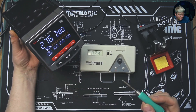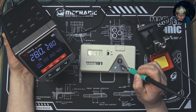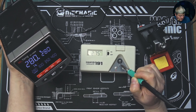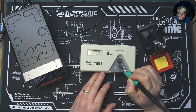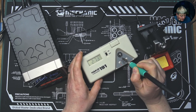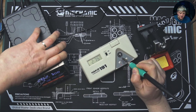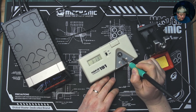I'm going to take my soldering iron and we're gonna see - it shows 280 over there. Let's see how many degrees it shows on the thermometer. So 285, 282, 280, 277 - because I'm not keeping this one properly on the tip, but anyway it's quite close. Now switching to 300 - channel 300 is now selected. Let's have a look: it's boosting up to 313 then stabilizing.